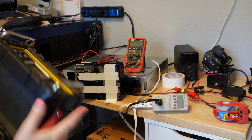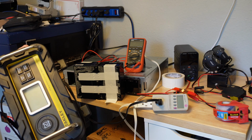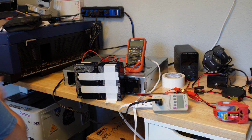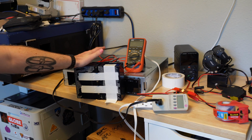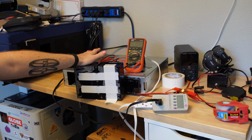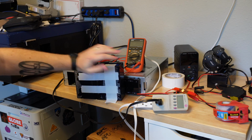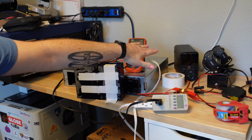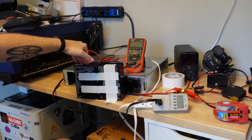These things usually try to make sure that it is a 12-volt battery by checking the voltage before they'll do anything, and I think the voltage on these batteries was just too low for that to pass. So I set my bench power supply for 13 volts, hooked it up to the battery, 0 milliamps, right? Like all zeros as far as the display reads on that, which is to the milliamp. After maybe 12 hours, 4 milliamps.